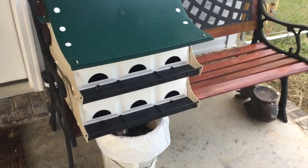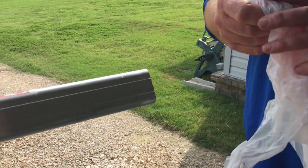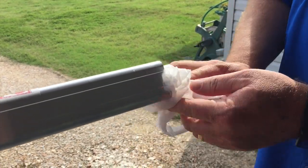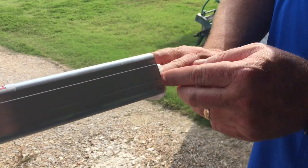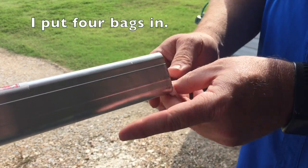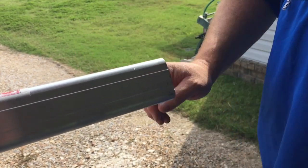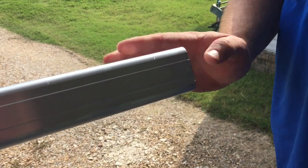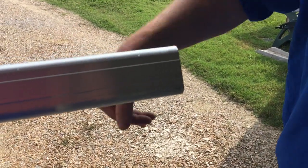We're about to put the pole up. One other thing you have to do is shove some bags up in the hole here — this is the bottom of the pole. When we slide the pole down, it telescopes up and down. The bags act as a shock absorber so it doesn't hit so hard on the concrete base. It'll just slide and soften the fall.